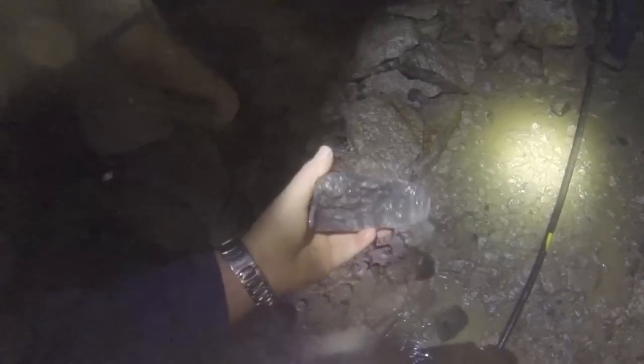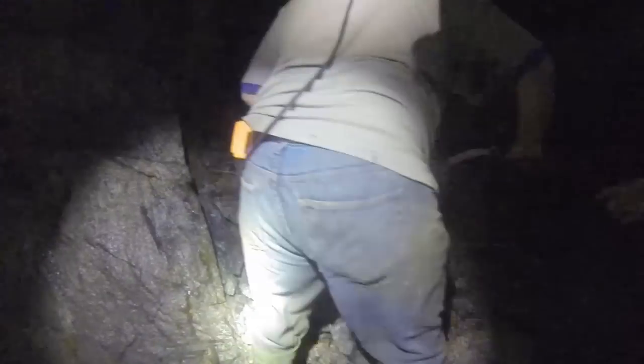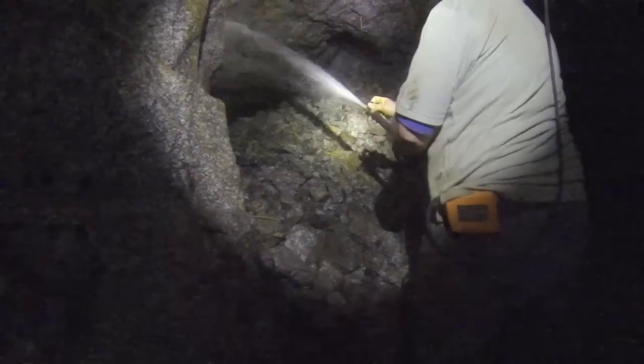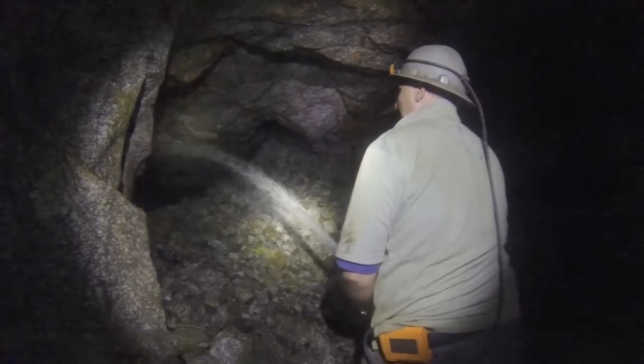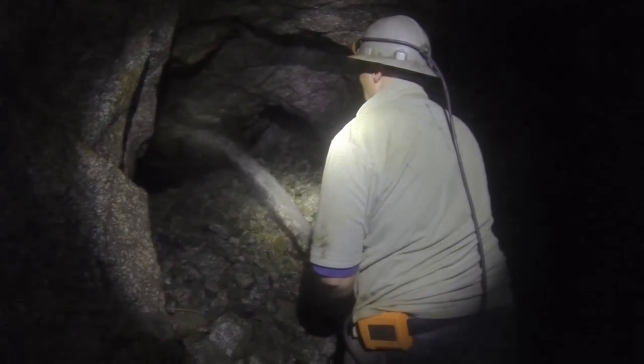When the explosive gases have disappeared, we head back into the raise to retrieve my camera and to check the round to see what's happened. The rubble has to be washed down first, as the dust from this is very dangerous and could cause silicosis. In the old days, many miners died of this, as they didn't know the dust was causing the problem. After Mark's washed down, I take a look at the raise, and the round has come out clean.